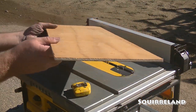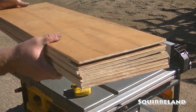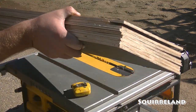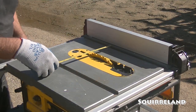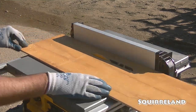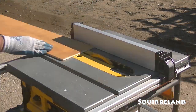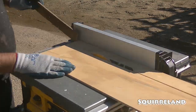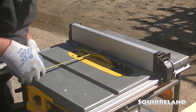Next I'm going to use these scrap pieces of one-quarter inch plywood to make the edges of the packing crate design. I ended up cutting multiple strips of wood at several different sizes: two and a half inches wide, two inches, one and a half inches, and one inch. These different sizes should give me enough variety to make a few different sized packing crates for this design.